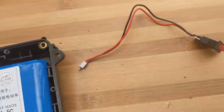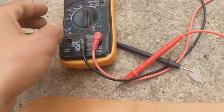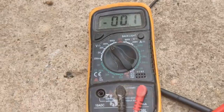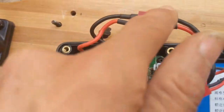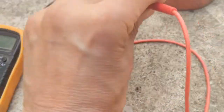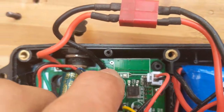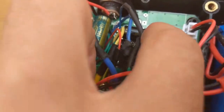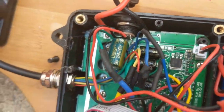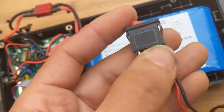The problem turned out to be just the switch, and the manual wasn't very helpful for pairing. For a beginner repair video: you need a multimeter. Check the voltage here — 20V or 200V range — because it's a 25V battery, to see how far the voltage advances. The most valuable function for me is this diode tester with its output on short-circuit, so you can really check these components. I was first confused because there's a diode here, but no diode was inserted. I tried inserting one and it started up. I also checked this switch — it's rated 5 amps — and if it switches on and there's no short-circuit, then the switch is simply broken.